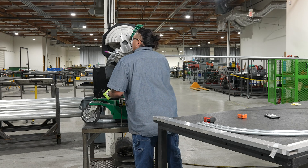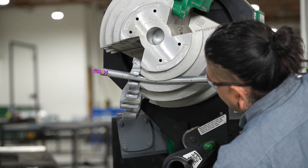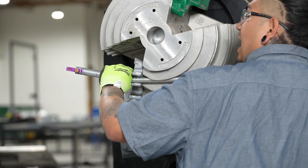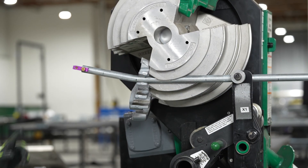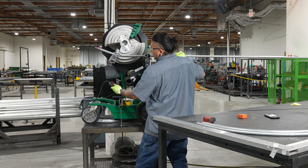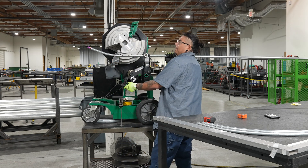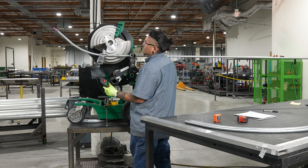After I verify it's nice and level, I'm going to loosen it and push my pipe right on through. On your no-dog you're going to have a little leveling window — make sure that's level before you commit to the full bend. We're going to keep repeating these steps, making sure we take our time. You may need two hands to roll it into place, and if it's too tight you can always loosen it.